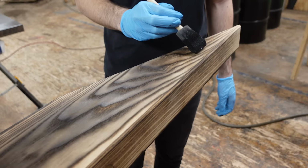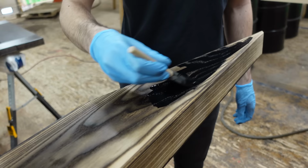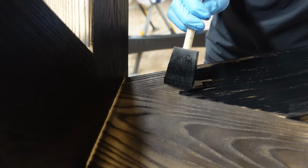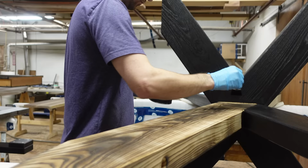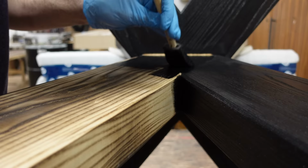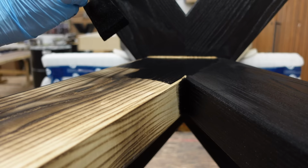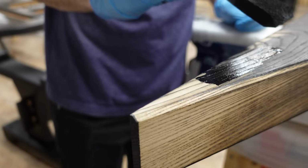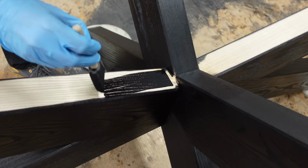Then once we finish charring and brushing the piece, we come along with our General Finishes wood stain. It's just obviously the black color, and we do sell this on our website as well if you want to find that. We'll put a link down in the description. But we found that this stain works the best for staining things like just that consistent deep black color. It does a really good job at hiding any variation in the wood grain. Like you can see on this piece of ash, some sections are burnt more than others, but by the time we put this stain on and buff everything off, we get a completely consistent finish on the grain.